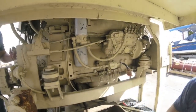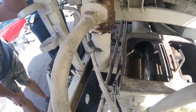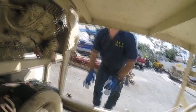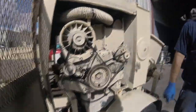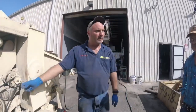That's it. You got fuel filter, oil filter, air filter, straight up. And like I was saying on the hydraulic side for your main tank, you're going to change this at 250 engine hours. 10W30 on the engine. Your belts are over here. You go through Deutsch, but Napa matches them up pretty good. And it's just a one-wire alternator, just like on a GM.